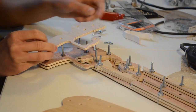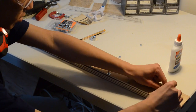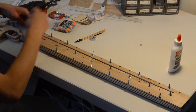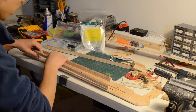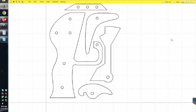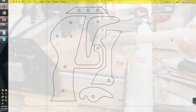The last change I wanted to make was to glue the slingshot together into two halves to make assembly and disassembly easier. On the Mark 1, I was always fighting the curvature of my warped plywood pieces as I tried to align all of the bolt holes. By adhering several layers of wood together, not only will I have fewer pieces to keep track of, but the lamination process locks the wood into laying flat. I created an SVG for all of the smaller pieces to cut out on the CNC, but the larger pieces I still had to shape by hand.